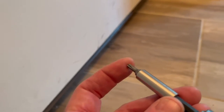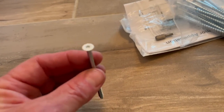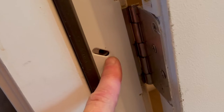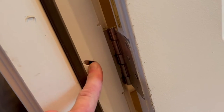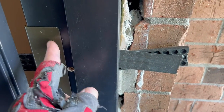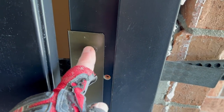With those done, use the provided star bit and you can put those in. I would recommend pre-drilling. The screws they give you are three-and-a-half inches and they are color matched. Now with those in and flush, I'm going to test the door again before I put in the screw into the hinge. The door is working. Now with those two screws in place, I want to countersink that hole, because I did this before and the screw didn't go in deep enough and it was hitting the hinge preventing the door from closing. You really have to get these screws flush or below the steel for the door to work. Otherwise the hinge and door hit against the screws and create a hinge bind. I actually had to use my countersink bit to make that taper a little deeper because the hinges were hitting that.